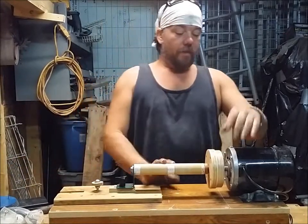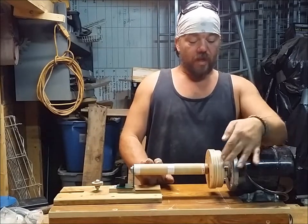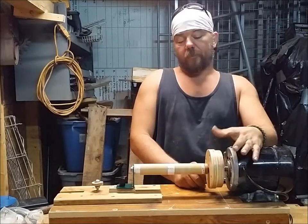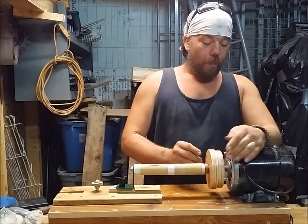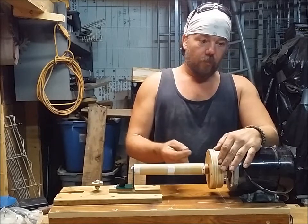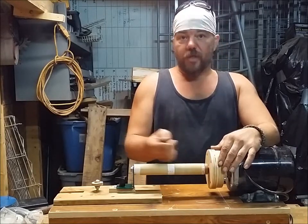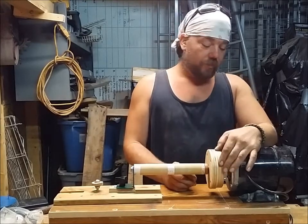The next thing I made was this — just a piece of plywood that I put on the shaft, turned it till it was round, and tried to put it on there as straight as possible. Part of the shaft is flat, so I used a piece of oak and made a shim to go inside to help stabilize it and kind of lock it in place.